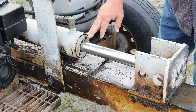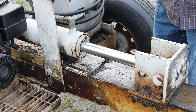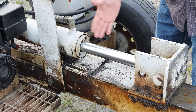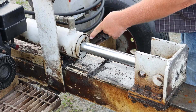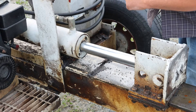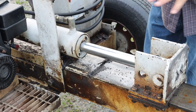Since last fall it has been leaking some oil here. In the wintertime it wasn't terrible. I tightened this packing up a little bit — I guess that's what it's called; I'm not a hydraulic expert by any stretch. This looks like it's been tightened many times because somebody's peened over the recesses, just using a chisel or punch method. I tried tightening it up a little bit and it's still leaking around the seal.